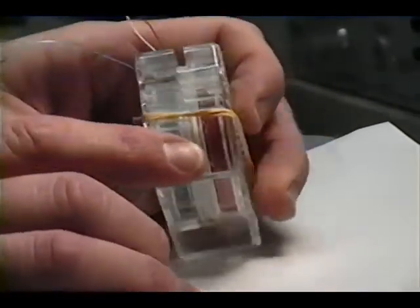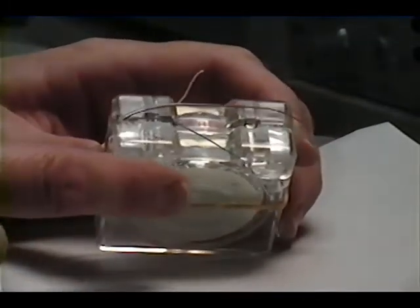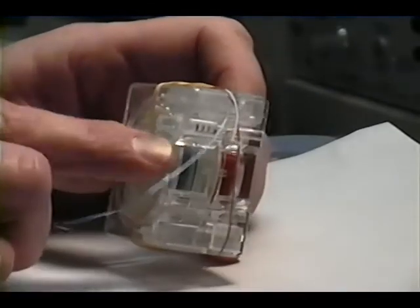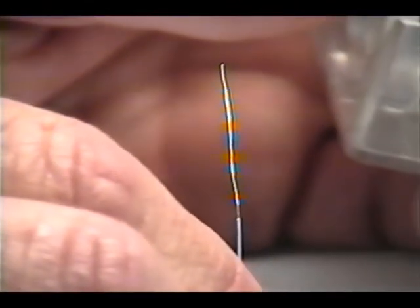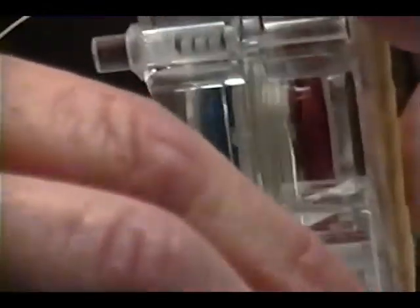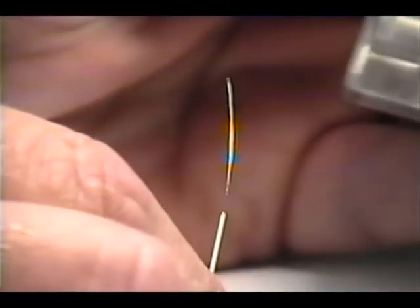Now to measure, cut, and strip wire, we've provided a transparent plastic tricolor wire wrap dispenser, which we can refill. If a unit wears out we'll replace it; if it becomes empty we'll refill it. This tool not only cuts wire, it also strips the wire in one smooth operation. There is a little notched metal tab that removes the insulation from the wire. The wire is forced through the stripping die, then the cutting button is pressed, which cuts the wire and removes exactly one inch of insulation. Doing it again with the gray wire: insert into the stripping die, press the button to cut, pull the wire through, and you have exactly one inch of bare wire.